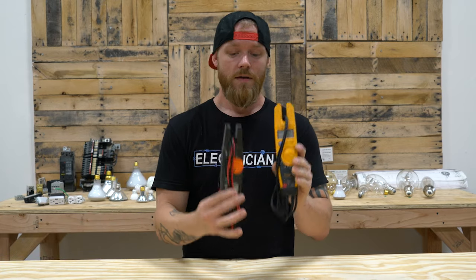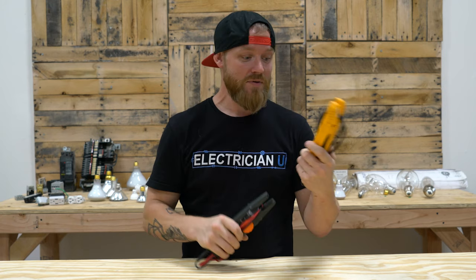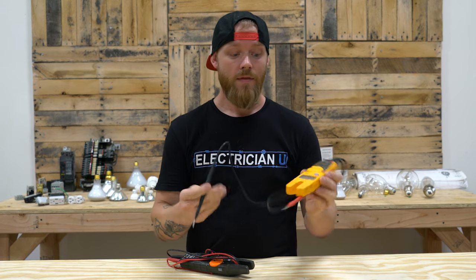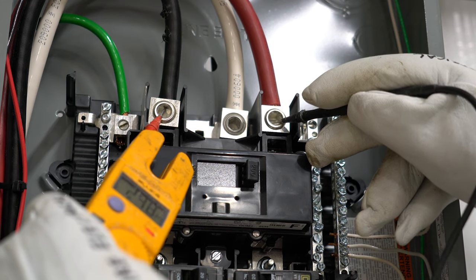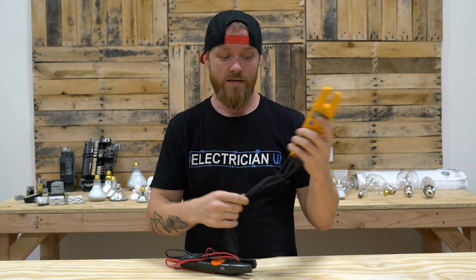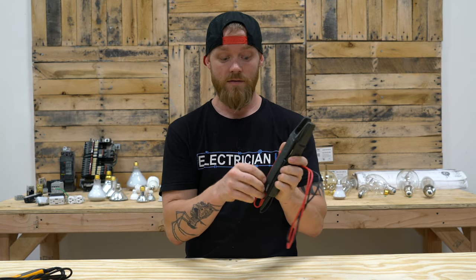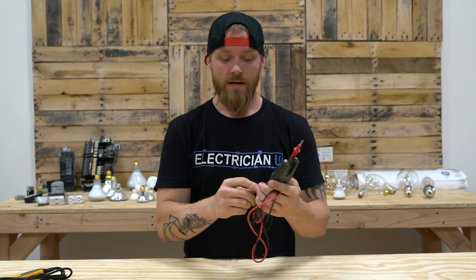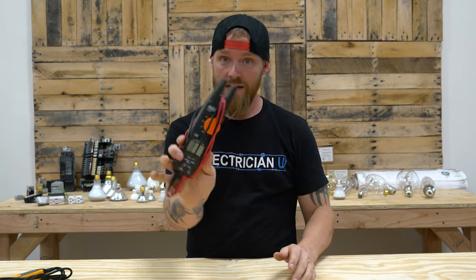There are two different models. I'm kind of picky on where the knob is in relation to the screen — I find the screen gets covered a lot on one but not the other. I would choose a multimeter that has a slot to hold at least one lead, so you can see your screen and use both hands when taking measurements. This is the T5-600 from Fluke and the CL-360 from Klein. They both have the same functionality. Klein's has two spots so you can put either lead on them. Basic multimeter — not 700 features, just the basics.